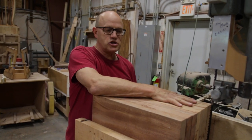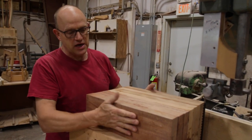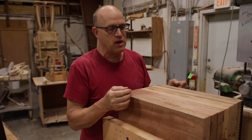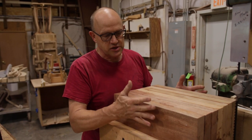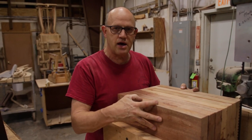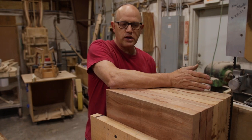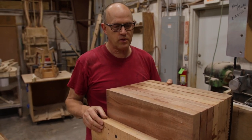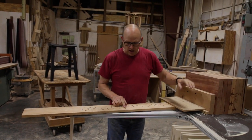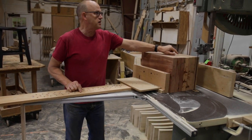We've got some customers that want cherry and some that want mahogany. Earlier today I did a lot of poplar ones. Each time we set up a block like this we lose one seat because of the drop from the top and the drop from the bottom. I've tried to glue those together because there is enough material and shape to make a seat, but generally it distorts too much off the cut. I've found it's a lot easier to glue the pieces together before sawing and not try to glue them together afterward. Each time I make a cut I'll have to lift this up and set the next hole over the pin to cut the next curve.